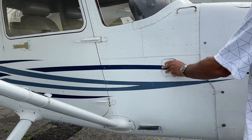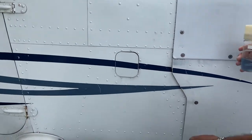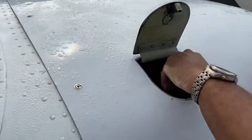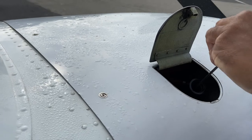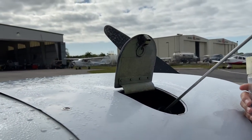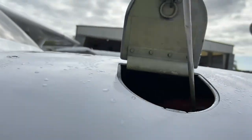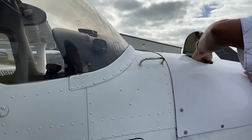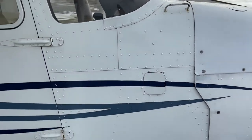What is this here? It's going to be for the avionics cooling — to allow air to come in. That's supposed to be open, yes. Check the oil — nothing lower than five, nothing greater than eight; six is the sweet spot. It's about six and a half, actually almost seven — looks nice and clean.